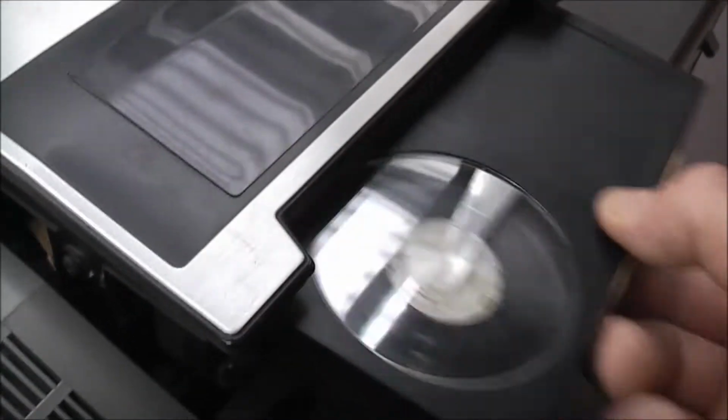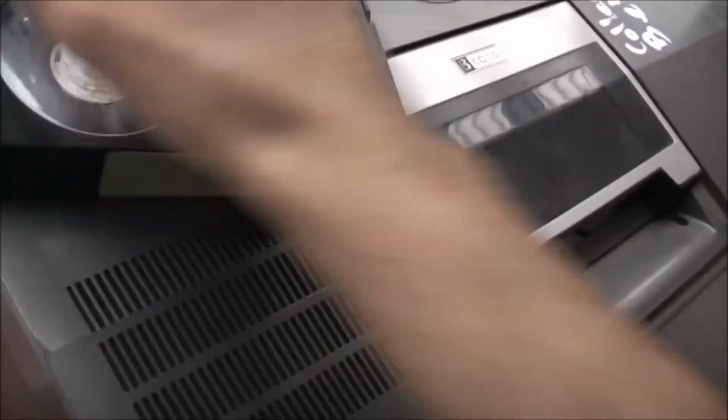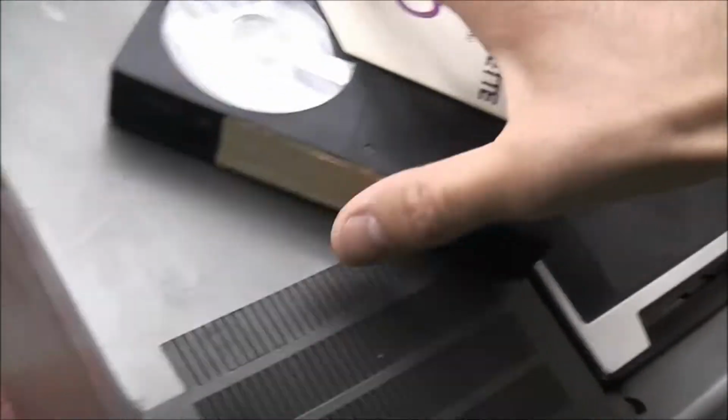I'll do a quick video, do a test on here. The motor's going. Oh, taking the tape up. Couple of clicks. Looks like it's an idler issue here. Yeah, can't play it. I'll have to fix that. Eject. Lines the tape back up. Well, that works. Okay, well this one's more promising. It's just got idler issues on here. Sounds like one of those logic control tape decks with bad belts, just clicks and it slips. Doing the same thing, so check idlers, check belts. That'll probably be all that's wrong with this one.